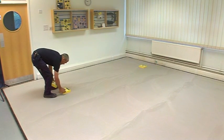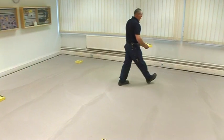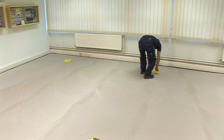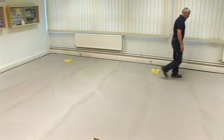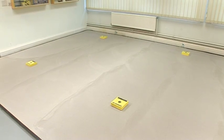Allow enough time to elapse for the trapped air to reach moisture equilibrium with the screed or base. This can take at least four hours on a 50 millimeter thick screed where the damp-proof membrane is placed between the base and the screed, and considerably longer for thicker floor constructions.